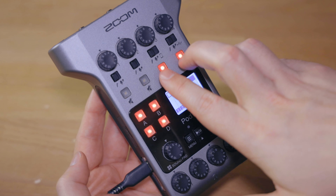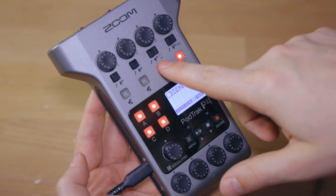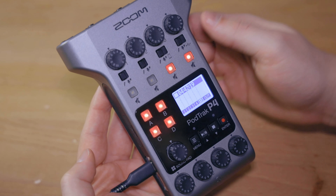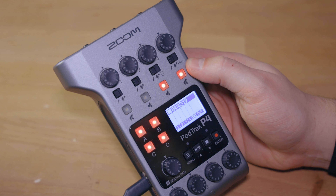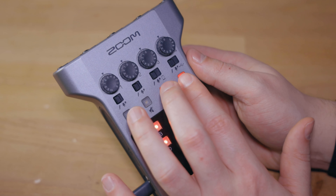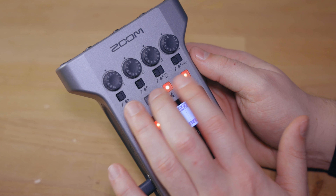The same can be done on channel three and four. However, there you have to set the switch to the middle position and not the far right, because the far right position has a special meaning. On channel three it is the phone integration and on channel four it would be the USB-C integration so you can use your computer audio and record that. Something to note: when you use these integrations like the phone call or the USB-C audio interface component, you're actually going to lose either one or both of these XLR ports to those functionalities. So you can only use two or three XLR ports combined with the phone call, or three XLR ports with the computer integration — but not phone, computer, and four XLR ports simultaneously.